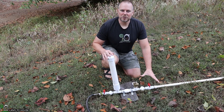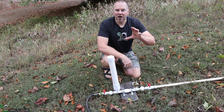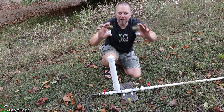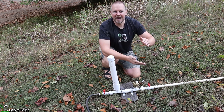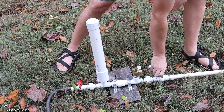I've got a three-quarter inch ram pump set up with about three feet of input head pressure. I'm going to test out this pump filling a jar at the top of the delivery pipe with a normal three-quarter inch valve, and then we will try the half inch and then the one inch and see if that makes a difference with the amount of water we get at the top. I have the waste valve turned in this direction so it will close easily. Let's go ahead and get this started.